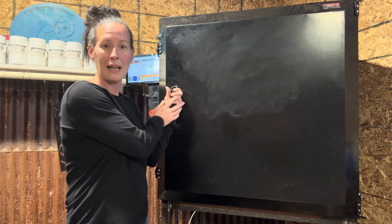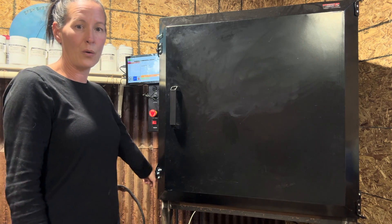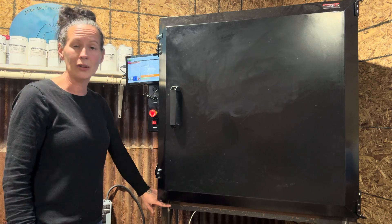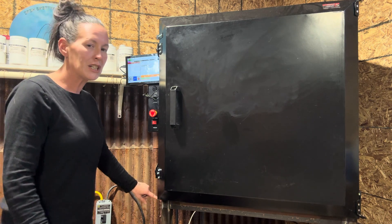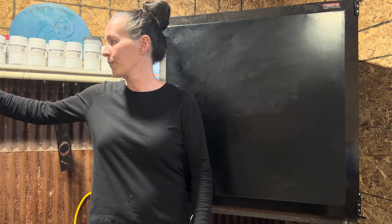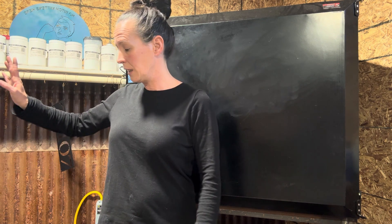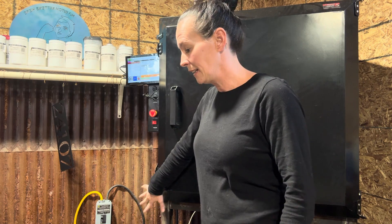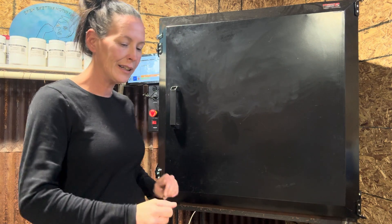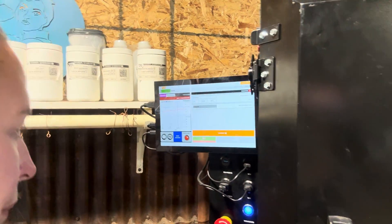What we did to make sure I didn't get electrocuted when touching the machine: we attached a white cord to the stand we built — we didn't buy the stand, we built it — and we just direct-wired it into the earth ground that the CNC machine is connected to. The Vulcan 16 is now connected to that ground as well.